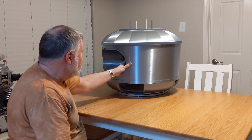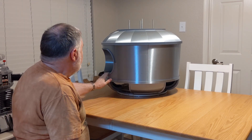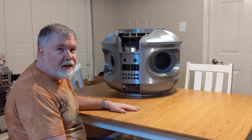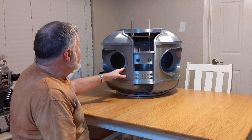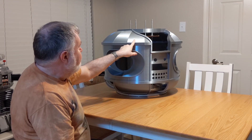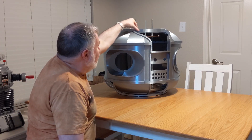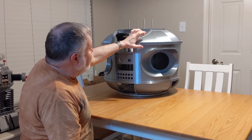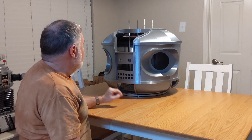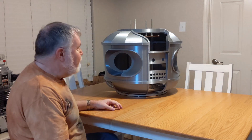I'm out of PLA right now, or at least that brand I was using. I may try another brand. I hope it matches up, but it'll stay together for now, and I'll eventually have to print that over. Another reason it's nice to have these multiple pieces is Ian Hughes is the one who's designed the parts for us — thanks again Ian, he's doing a great job. We both discovered that this piece right here, along with this piece right here, will actually fit on most printers. So it's better to print this as one piece — one piece up to here with the collar part there. My first one didn't print very well — that's the very first piece I printed and I realized I had to have the temperature up a little higher. So I was planning on printing that again as a single piece. That gives you another advantage of printing: you can take out a piece and redo it if it broke or you decide to do something different.